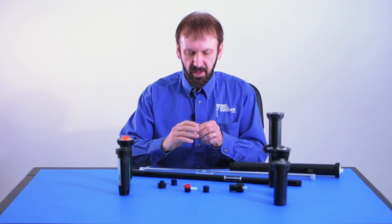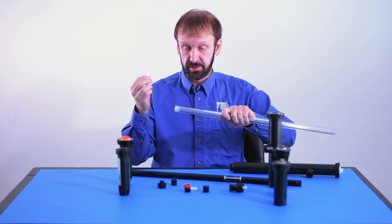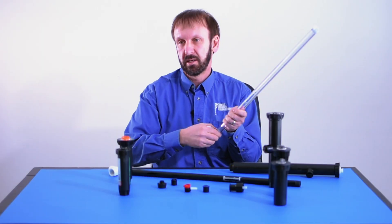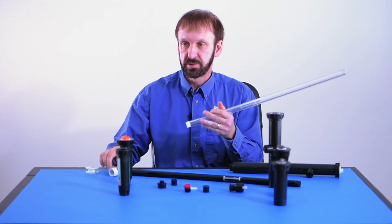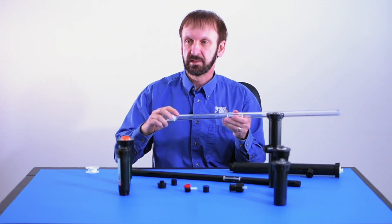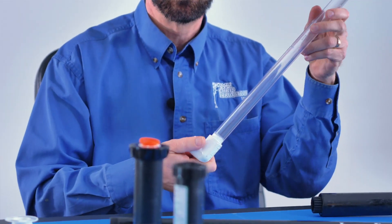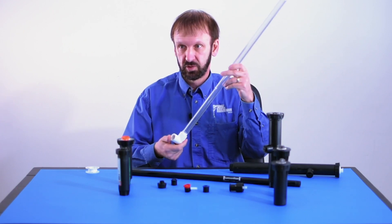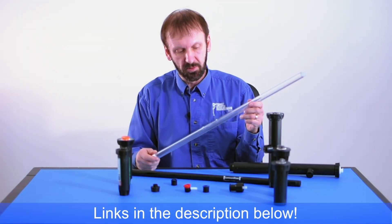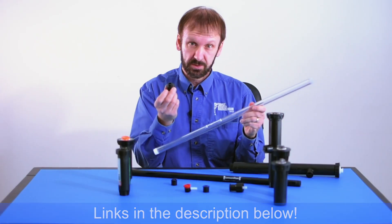I know this is controversial, but we believe in using thread seal tape on PVC to PVC threads — especially with the Samson riser, because the Samson riser is many times stronger than PVC and it will strip your fittings every time without using thread seal tape. It also adds flexibility to your fitting and in the future it makes it easier to remove nipples and change things. So thread seal tape, in my opinion, is a good thing. We have put links in the description below for those having trouble finding the Samson riser and the Hunter shrub adapter as well.